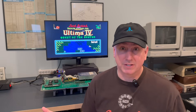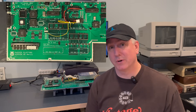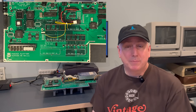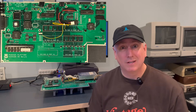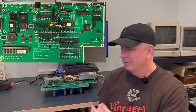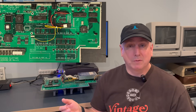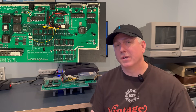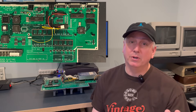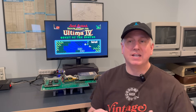We're going to start with one that I've actually built myself: the H5 Phoenix board. At the time of this video, these boards are available on Exos's store. This is a series of boards developed by Chris Swinson, AKA Exos, developed with a broader community as well. This board is a drop-in replacement for your Atari ST motherboard — or if you're really adventurous, you can adapt it to some other form factor, building an entirely new system from scratch, 3D printing a case, etc. It features, among other things, an enhanced video DAC, built-in ST to VGA support, electrical fixes and upgrades over the original boards, and a lot of different nice-to-have features.